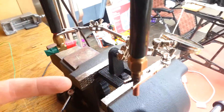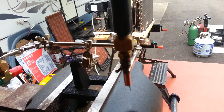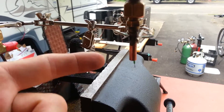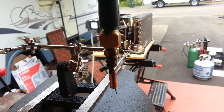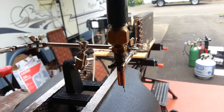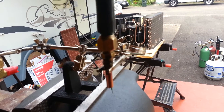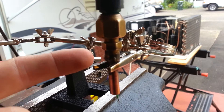Now, this one here is quite a bit different. Same construction technique overall, but you can see there's no T on it, and the wire is considerably longer sticking through than with the T. The reason for that is this one's actually going to be mounted inside — probably to the side of a one-inch copper pipe. I'm going to drill a hole and braze this stub. You can see it has a male quarter-inch flare here.